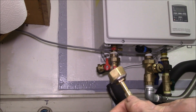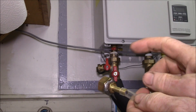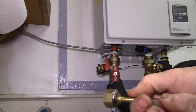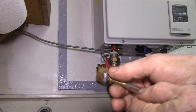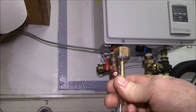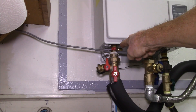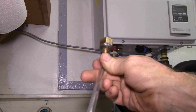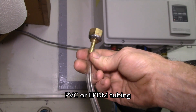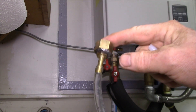As a first test to see if this works, I used a compression nut from a shutoff valve for a faucet — it has half-inch pipe thread inside and is made of brass. I had a hose barb fitting and found they made a perfect fit together. I wire-brushed the brass, put a little flux on, got my propane torch, and soldered the two together. This is just a proof of concept. The clear vinyl PVC tubing is what the manufacturer recommends — PVC or another approved drain material.